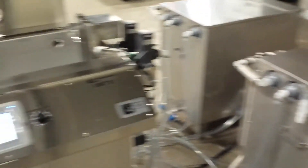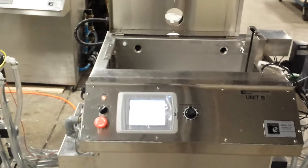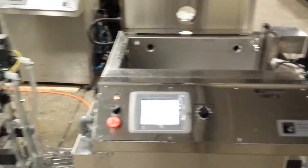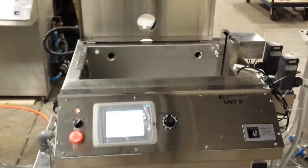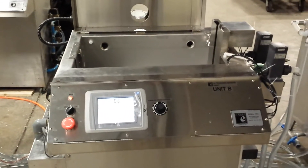The way the system works is upon activation of a cycle, the tank will fill with the first wet process alkaline detergent, so it'll pump from tank number one alkaline into the process unit. Ultrasonics will commence when the tank is full to do a wash of your parts with alkaline detergent. Then the fluid will pump back into the alkaline tank.